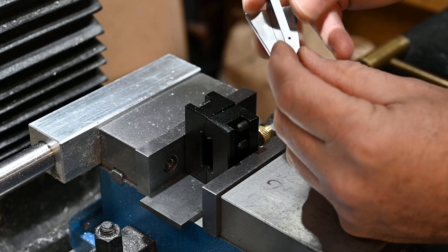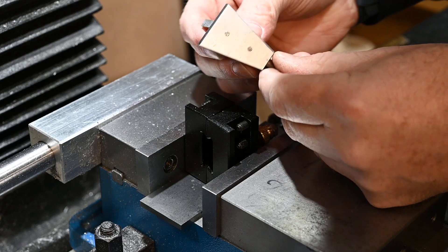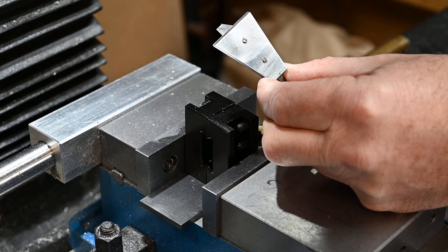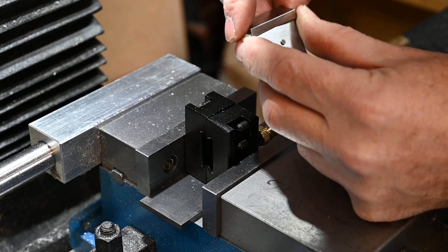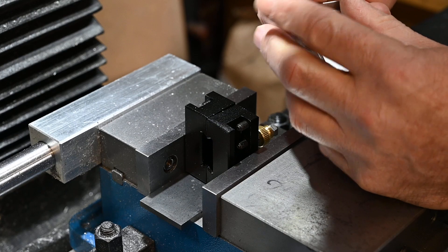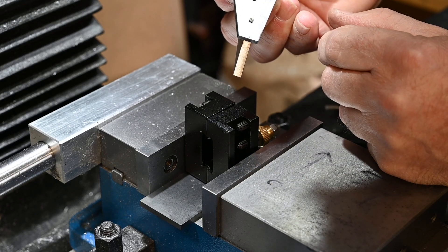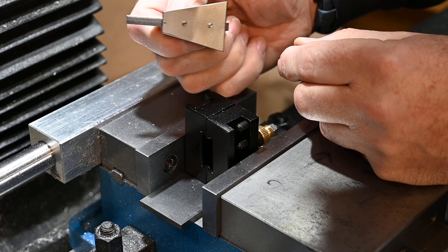I can soon fill that up — I'll make a little dowel pin and put it in there. Anyway, this is the idea, so now that's held in position. What I need to do is get this plate — this plate can now be fixed, I can screw that down onto there. I'm going to screw that plate onto there and then the other one onto there, and then that will hold it all nicely in place for when I silver solder it.